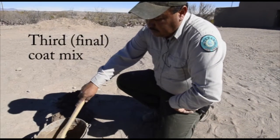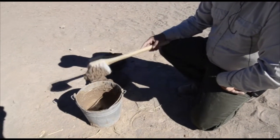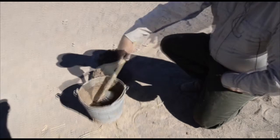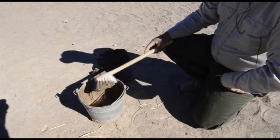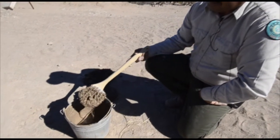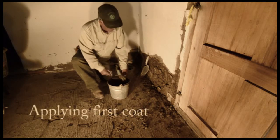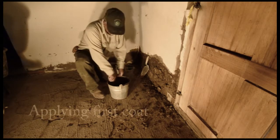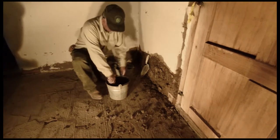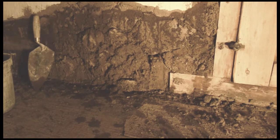This is what we're going to use for the final coat — this is what you want to see running. It's the same process as the second coat but with just more Aerospray 70 mixed in with water. We're trying to do some plaster on the inside of the structure. It's going to be the first coat so you want it to be a little rough. You can see it has straw with the stones kind of mixed in.